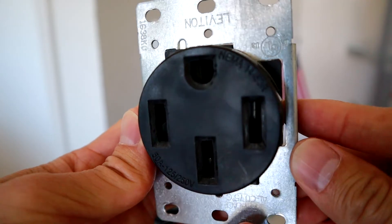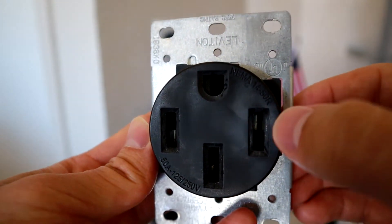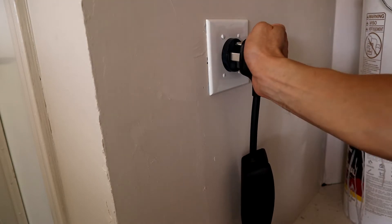With the dryer outlet, if you are unplugging and plugging it all the time, it'll loosen the prongs inside the outlet. What happens then is the connection between the prongs inside the outlet and your actual connector gets loose, and that's what can cause arcing inside the outlet. Arcing basically leads to fires, or at the very least melting of the outlet. When those prongs get loose, the outlet can't hold the charger plug tightly — and you want a really secure tight connection because that's how current flows through the charger securely. When it's all loose, that's how arcing starts, with the prongs moving around inside the outlet.